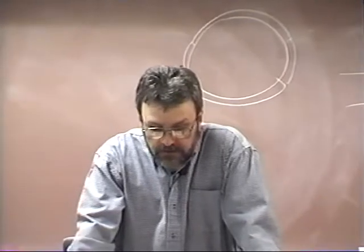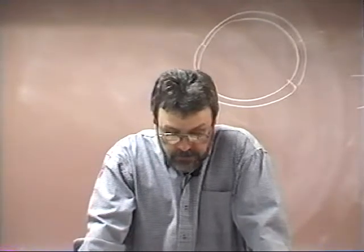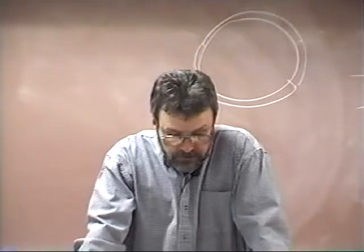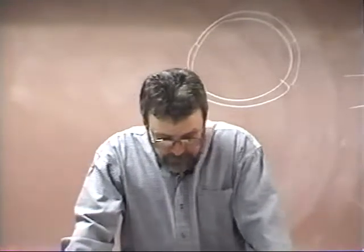The following items must be stipulated: the material to be welded, the welding processes, diameter, position, direction of welding, number of welders, time lapse between passes, preheating temperature, interpass temperature, filler metal classification, cleaning procedures, etc., etc., etc. Study that. Know that. Depositing root bead, heavy wall pipe, large diameter pipe. These pipes are known for their higher strength.